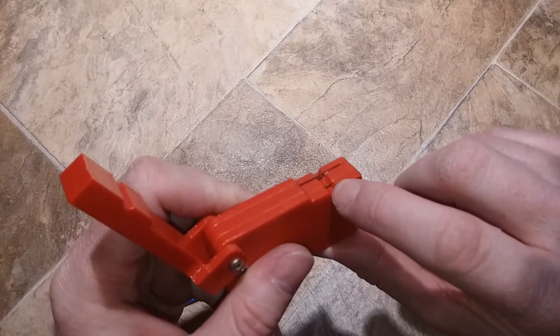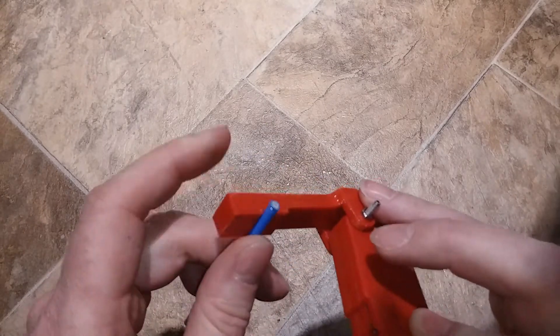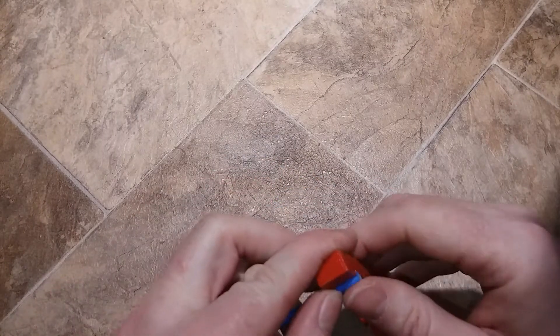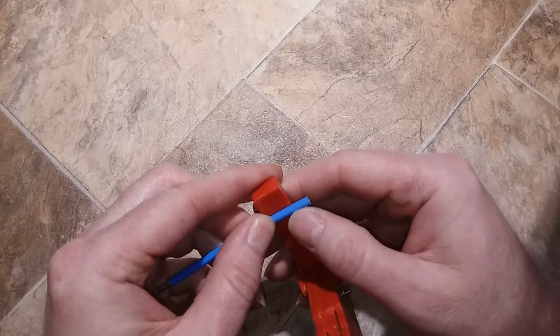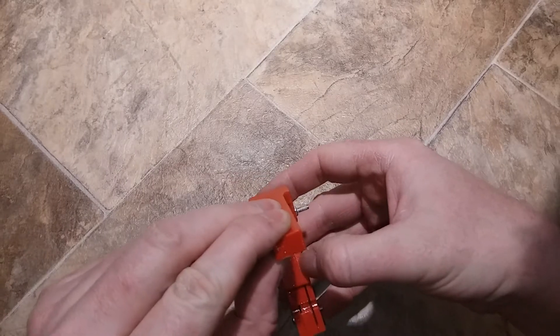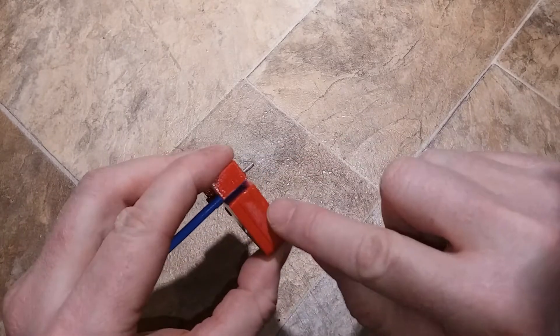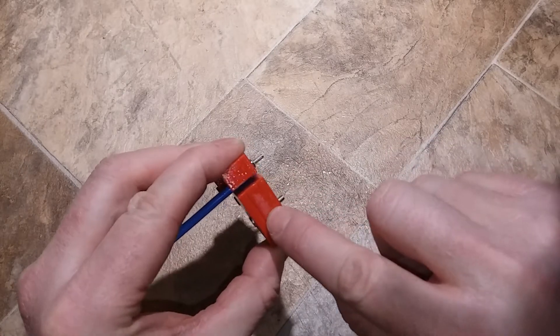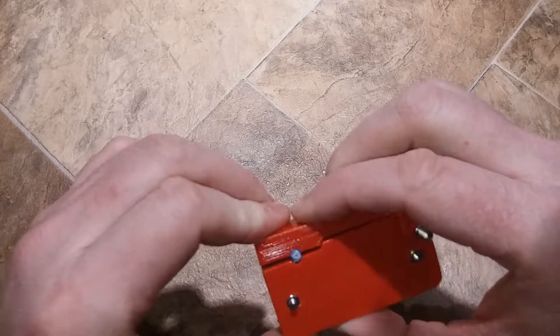This just cuts the outer insulation off. You put your cable in there and line it up as far as you want — if you put it out here then you have a longer wire. This measurement is 4mm from the end, I believe this is 6mm, and this is another 4mm. So you press down.